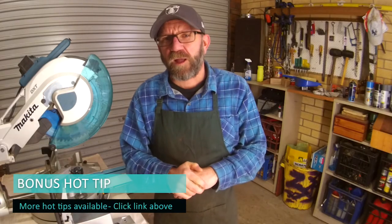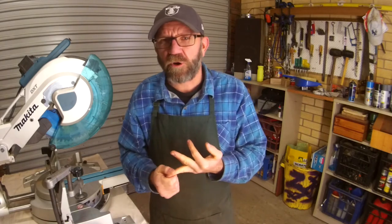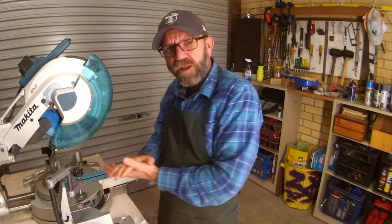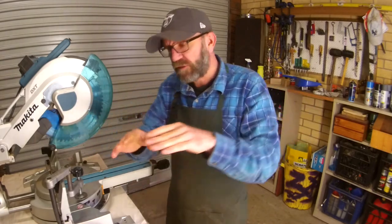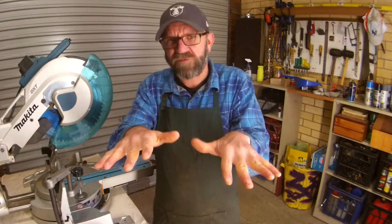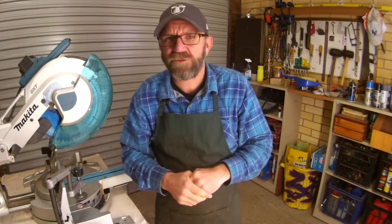Number seven — and I'm not sure if it's a hot tip — it's just my thoughts on the drop saw and some of the timber we might use. Any timber that has a bit of a twist or is a bit bowed, I wouldn't use it personally. It's no good on the tools, sometimes dangerous, and it ruins projects and joinery. If you have to use timber with a bow in it, make sure you cut it with the bow curling up — the idea is so if you cut through it, it bends down flat and your saw cut will open up instead of close and bind on the saw. Anything that binds on the saw doesn't end too well.